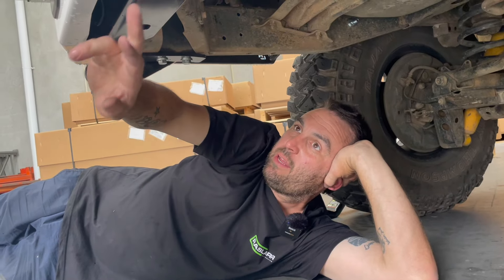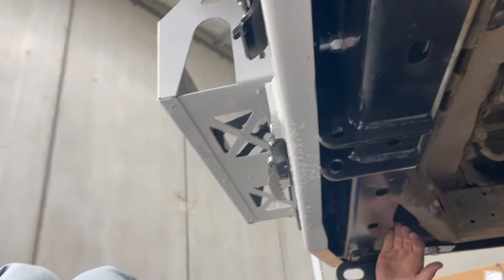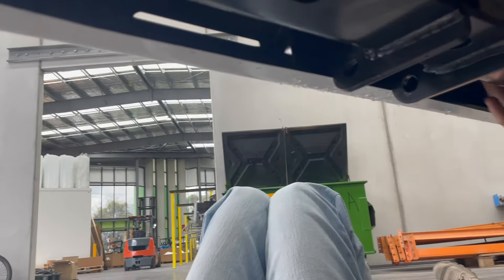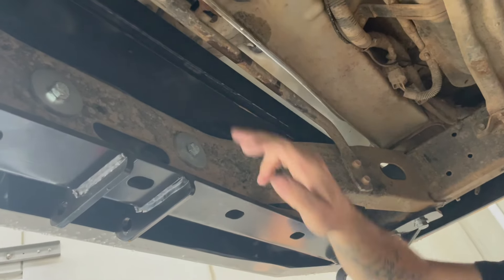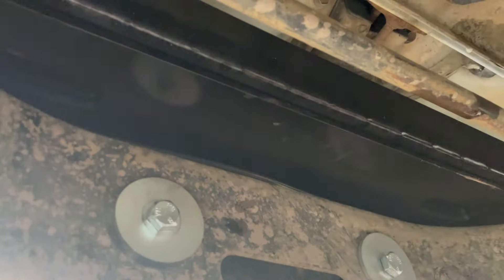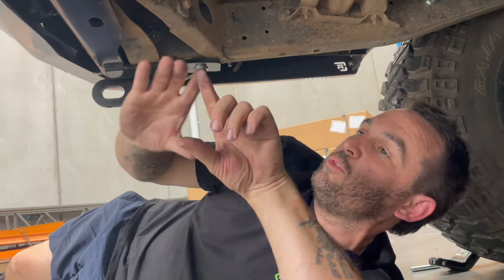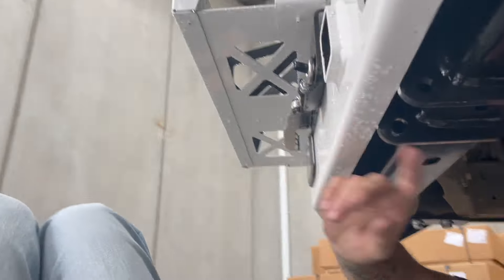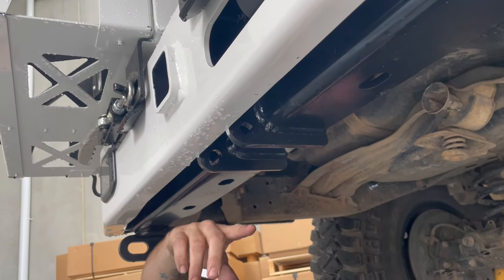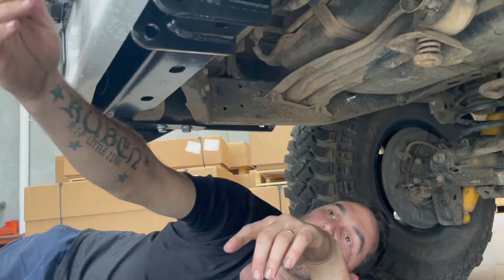Under here is what everyone wonders about. The way we've achieved keeping it up so high is the chassis actually dips up in the air here, so you're able to run this big folded cross member which ties up into the bar. This is an eight and ten mil combo — a big folded panel that welds back up. The bar body is six mil, folded top and bottom. You've got a large six mil C-section with a ten mil C welded inside going back the other way, making basically a huge box section all out of folded bits, and your tow bar passes through the guts. Your chain brackets join the two together fully welded, and then the chassis bracket does the same. So you've got a humongous box section, fully fabricated, and your hitch passes right through.